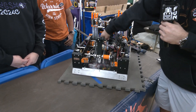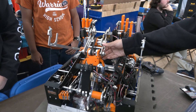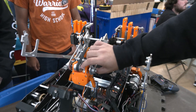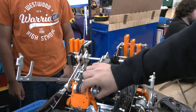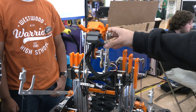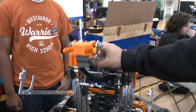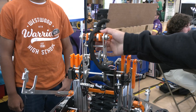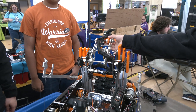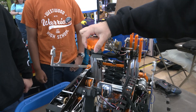The last thing on the robot for the sample sequence is the arm. The arm has an axle powered by two servos, and this axle spins, which is what the arm rotates on. Additionally we have another degree of freedom called the wrist — a servo right here geared to another gear that turns the wrist, which allows us to have freedom when transferring and dropping the sample to the basket. And finally we have our claw, which is powered by one servo.